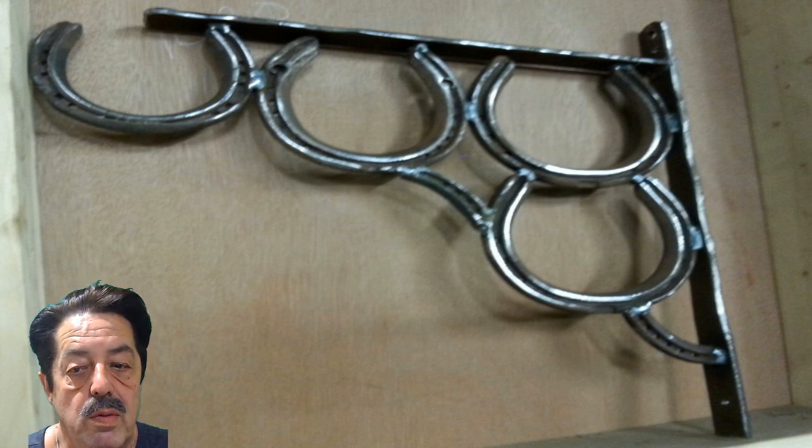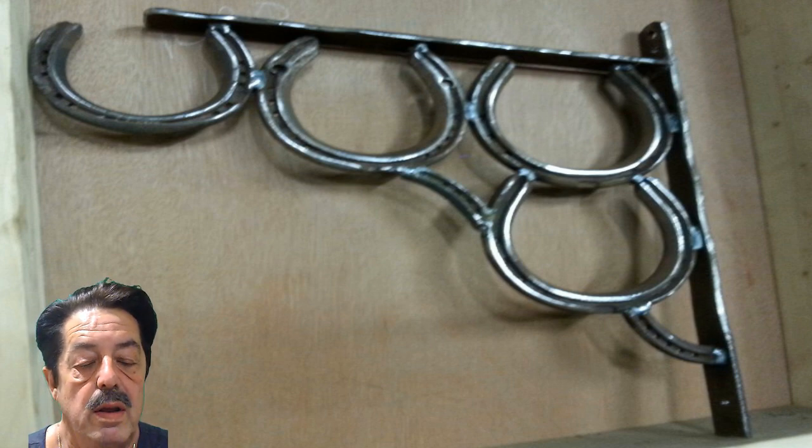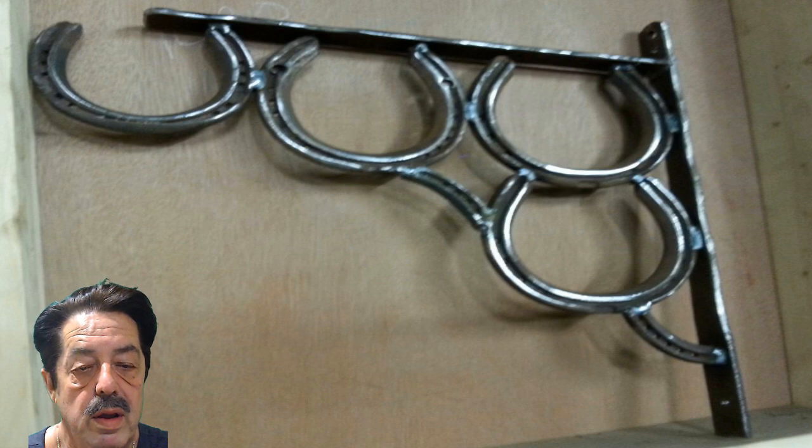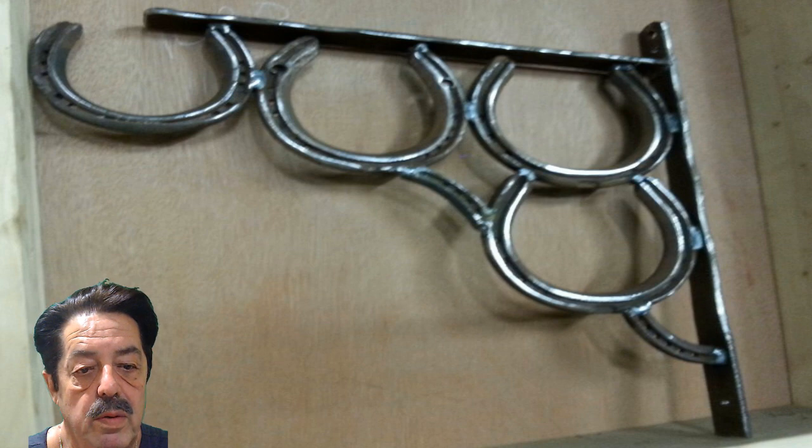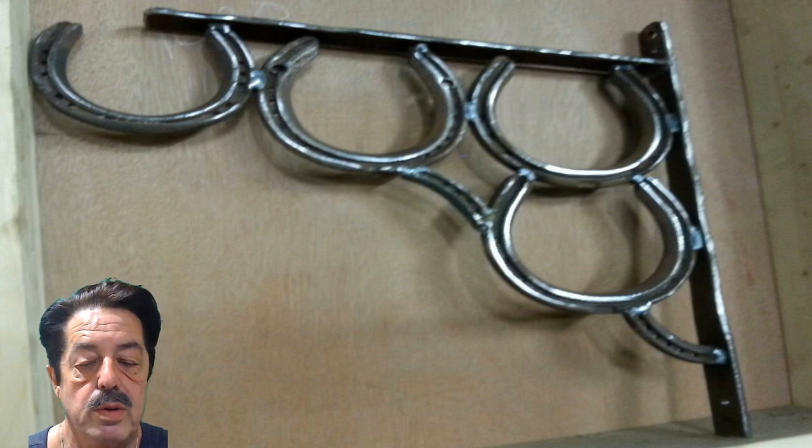Someone asked if I could describe some of the steps. With the flat steel, you can make that vertical piece come up a little higher so you can drill a hole, and I use a countersink bit so when they go to screw this into the wall the screw sets in and runs flush — it's just an added touch that only takes seconds. I do that on the top and on the bottom. Then I round all my corners off, whether I'm using a four-and-a-half inch angle grinder with a 60-grit or 80-grit flap disc — I round everything off on the tips of the flat steel. You don't really have to do that on the horseshoes themselves. Once your welds are done and everything's cleaned up, you're ready for the next step.